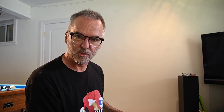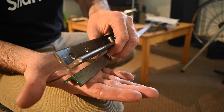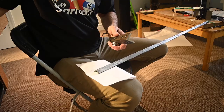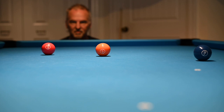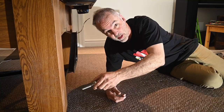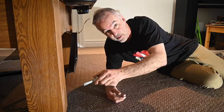So I figured the best way to get the pool table moving is to put it on rails. If Serge from Russia can pull a train with his teeth, I think we can move a 600-pound pool table. The idea is we've got two pieces of angle iron — one sitting on top of the other — with the pool table sitting on top and rolling back and forth. We took the feet off the pool table, which brought it down by an inch and a half, then put the table onto the sliding angle irons, bringing it back up to an inch and a half. So we started at 32 and a half inches and we're back to 32 and a half inches.